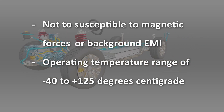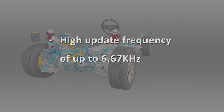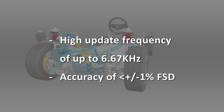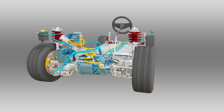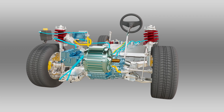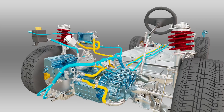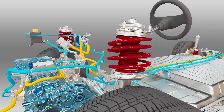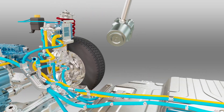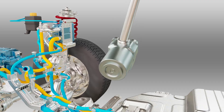It can be deeply embedded into an electric motor system. The high update frequency of up to 6.67 kHz combined with an accuracy of better than plus or minus 1% means it can be used to measure torque output of an electric traction motor to improve control, safety, and efficiency in an electric vehicle powertrain. In addition, it can also be used to sense the torque in an electric power steering system, controlling the input of the steering assist motor and providing further safety, efficiency, and measurement in that critical system.